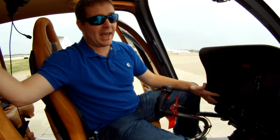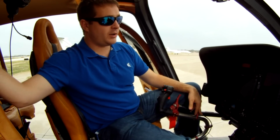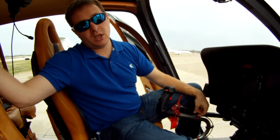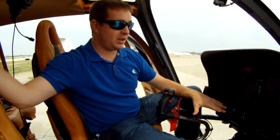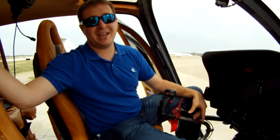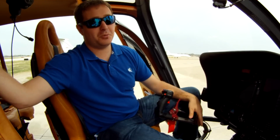So you've got a wide cabin here, and it's not quite as fast as that A-Star, but it's got great power, great range, and I think one of the neatest things compared to maybe a 407 or those Allison engines is that as soon as that FLI is turned on, or the engine is turned on, excuse me, the helicopter is ready to fly. There's no warm-up, and also it only has a 30-second cool down, as opposed to a lot of helicopters, the 206 in specific, it's about a 3-minute cool down. So that's real nice for when you've got passengers on board and they want to get out of the helicopter and stop those rotor blades.